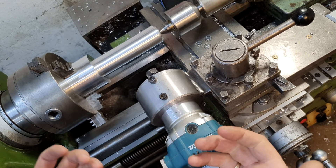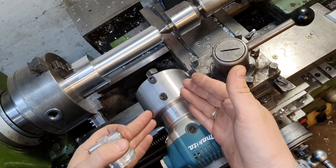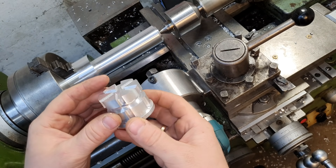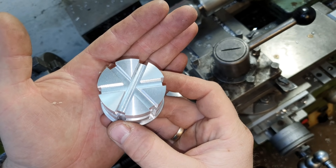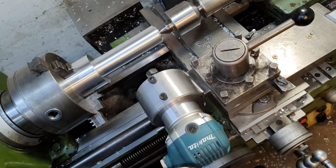Guys, welcome to the video. I continue to explore the lathe art. Today should be a quite interesting video. I want to try cutting threads using a milling cutter. In the previous video we made a holder for it. The milling cutter showed good results — it calmly removes 1mm of duralumin without strain, milling without any vibrations. And that gave me the idea: why not try cutting threads with it?